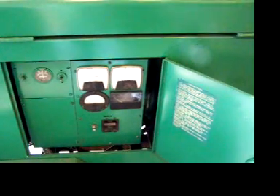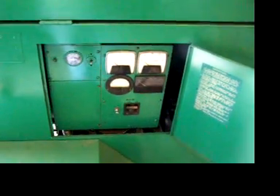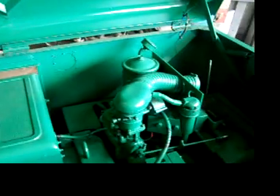You can see that with about a 1500 watt load on it, it held just over 60 hertz or right at 60 hertz after it warmed up a little bit. It was off for maybe 20 minutes while I grabbed the camera, so the electric choke might have started to close a little bit. But basically with a little bit of load on it, switching on another 10 or 12,000 watts of load leaves it within a half of a hertz. When everything was warm, nothing was hunting around — so I think that was a successful adjustment. Now we'll put the air box back in and close everything else up, and in the description I'll put the procedure from the Onan booklet on how to adjust everything.